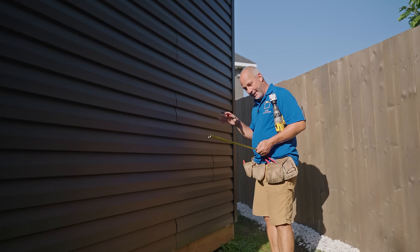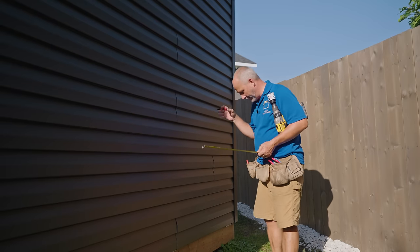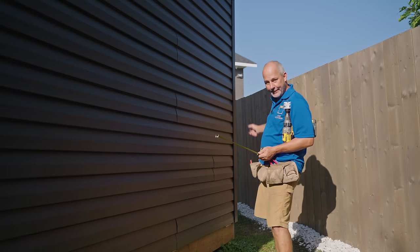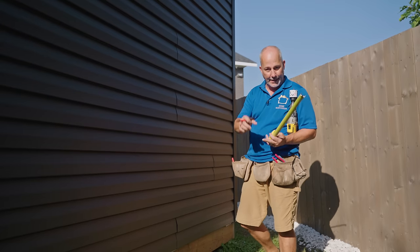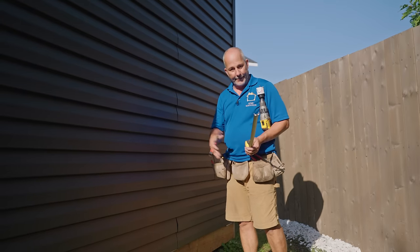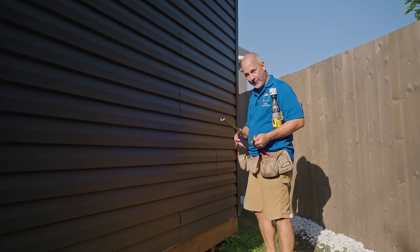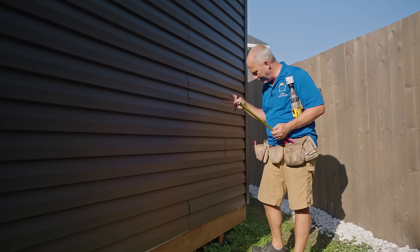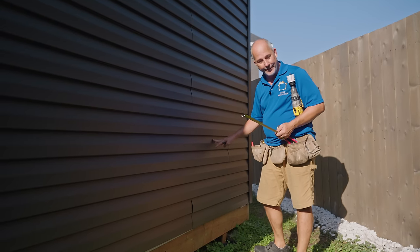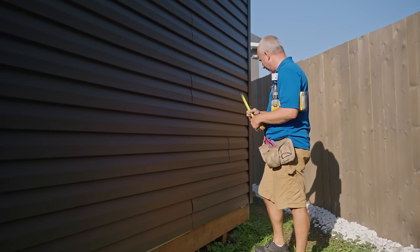come through the wall. Now, at a later date, when they wanna make this permanent power, you can dig a trench back to the panel, run your conduit, pull your permit, fill it up with the sand and then the red tape, warning tape, get all your inspections, backfill it, fix your sod. But for us today, what we're doing is we're just creating a temporary power scenario. So I'm gonna use an extension cord, but we're gonna do the penetration of the building as if it's gonna be permanent so that you can do the upgrade without having to change the siding, okay?